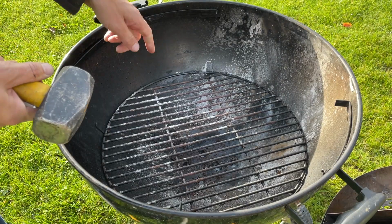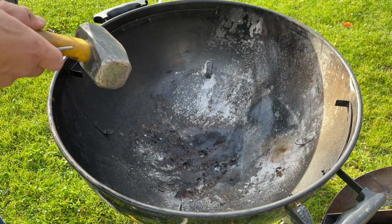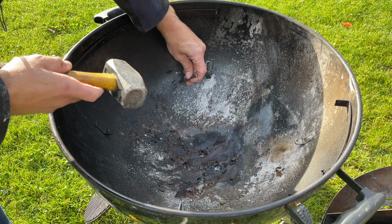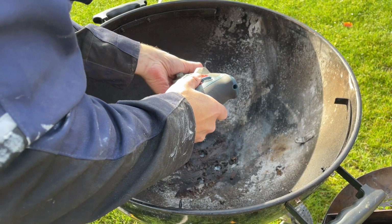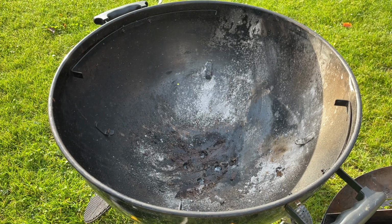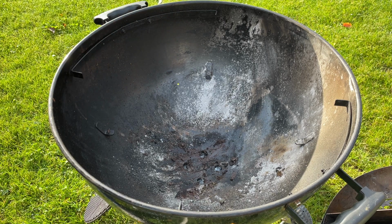Now I just rotated the grill, so I'm going to position mine right here, which is perfect for me. So just going to tap a little bit and then you get a pilot drilled. Drilling a small pilot isn't absolutely needed, but I think it really helps when following up with the step drill, so I recommend it. And as you can see, it takes 5 seconds.